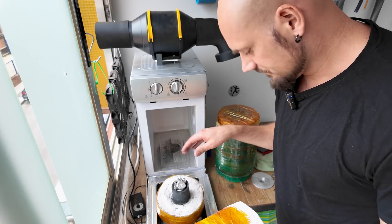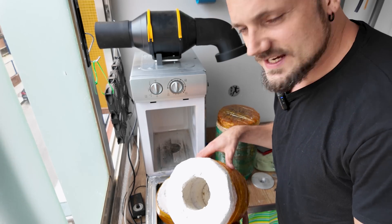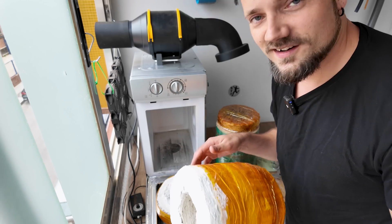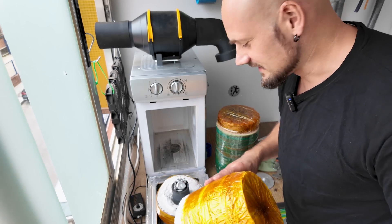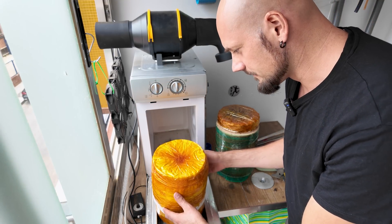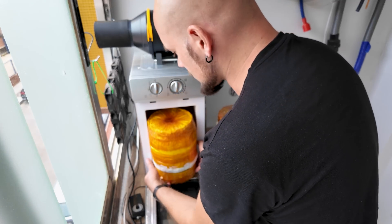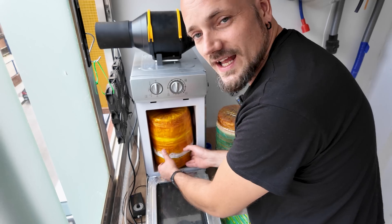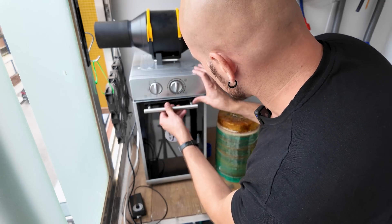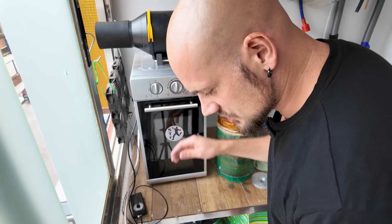For example: the state of your melting chamber, how used it is, and the size of the crucible. In this case it's a big chamber — I could fit a crucible way bigger than this one, which means it will take longer to melt this amount of metal. If I were trying to beat any records I'd use a chamber that's smaller, tighter, and new. I estimate it will take between 25 and 30 minutes in this chamber.